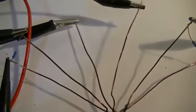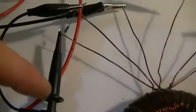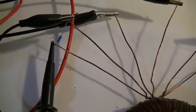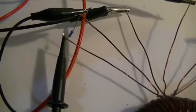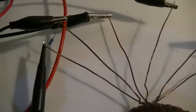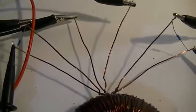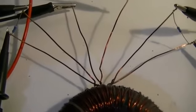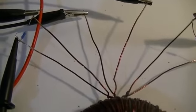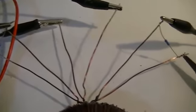Okay, I'm just going to tack this on the end. I've lifted the frequency right up. I'm just playing around with this setup. Now 11.93 megahertz. Now I'll just explain what I did before. I haven't changed the setup at all, but I have one of the scope probes hooked up in opposite polarity to the other, as you would have seen in the first part of this video. I haven't changed that, and the reason I did that was to separate the two waveforms on the scope so we could clearly see what was going on between the two coils.